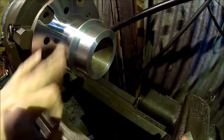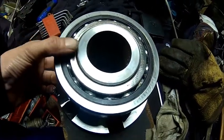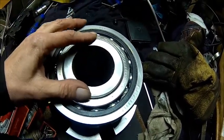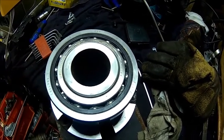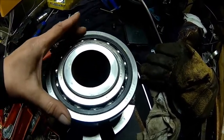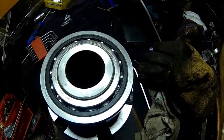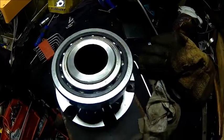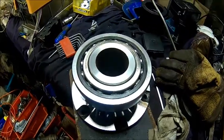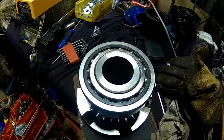Done — jump it, let's test it. So that's how it fits. We left about five millimeters here, so we need to make a plate with three holes to hold that bearing in. This is a used bearing but they literally don't move — maybe that much — so it doesn't matter. We cleaned the surface a little bit with the rust off. First we're going to put it in, see how it fits, and then we'll make the plate.